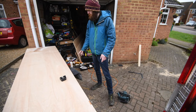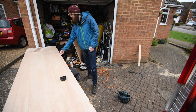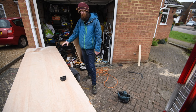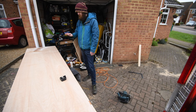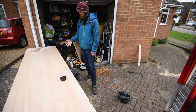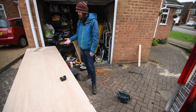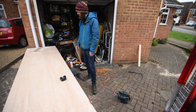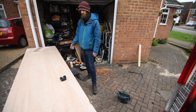Wood-wise, the cabinet top and all of the bed itself is going to be made from 18mm ply, but this is poplar core with a far-eastern hardwood finish, which is a bit rough but it was cheap — about £34 per 18mm sheet of poplar ply. The reason for going with poplar is it's a lot lighter, and for using such big sheets I think it's better to have that roughly 25% weight saving over conventional ply.